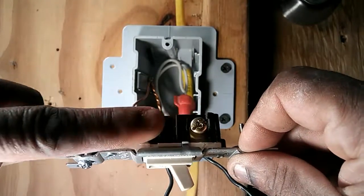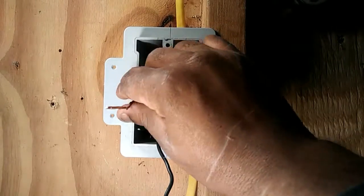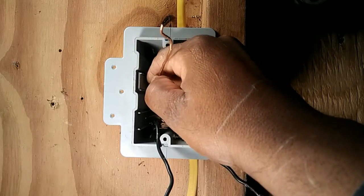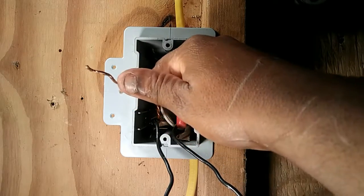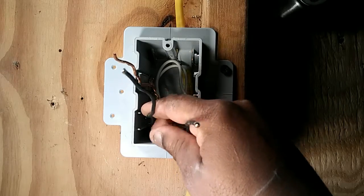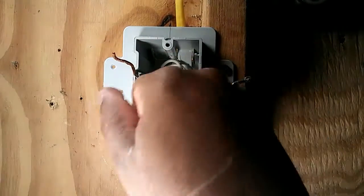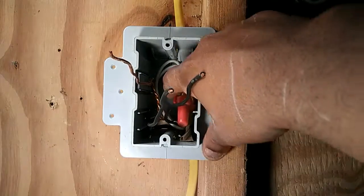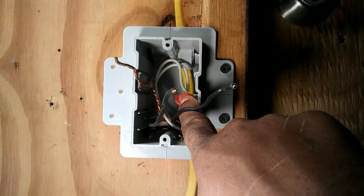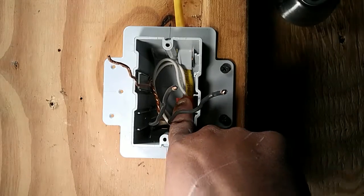On the copper screws is where the wires controlling your light will land. In the box you're going to have a bare copper grounding wire — sometimes this wire can be green. Then you have the two wires that will land on your switch. One comes directly from the light; it's called the switch leg. The other wire comes from the power source; it's called the hot feed. You also have neutrals tapped together passing through — coming from the panel, tapped with the white wire coming from the light. So you won't be doing anything with the white wires.